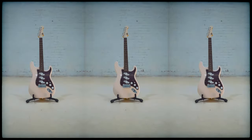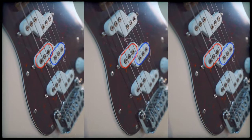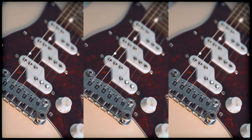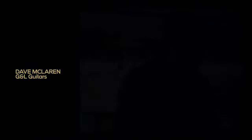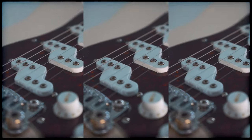This is a Z coil pickup, and you find them on all G&L Comanche guitars. It's the latest and one of the more advanced pickups designed by Leo Fender. Each pickup consists of two short coils wound in opposite directions with magnets of opposite polarities, so technically this pickup is a humbucker. However, each string is voiced by just one coil, so technically it's a single coil sound — giving you the best of both worlds: power and hum silencing, yet clarity and punch. Add on top of that Leo Fender's MFD tech, which gives a broader dynamic range, and you've got a pickup that stretches boundaries while remaining comfortable in classic situations.